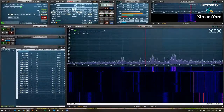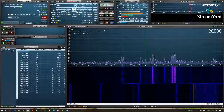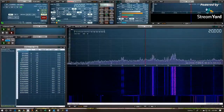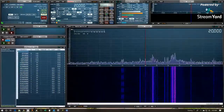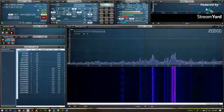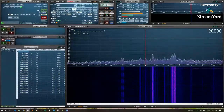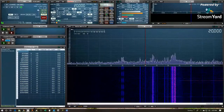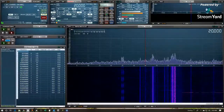Yeah, and I believe that is why they replaced that high Z port. I think they said in one of their videos that they found most people were set up like you, Tom, where they have a long wire antenna and they bring it into their shack through a short piece of coax, as opposed to bringing the wire right into the radio. Because if they bring the wire right into the radio, the last few feet of it starts picking up interference from the shack, their computers, or whatever. So I think that's what they found from their research, that more people would rather have that 50 ohm port so they can connect up to a coax, and then they can put an unun or a balun or something outside the shack, and it'll work better for them.